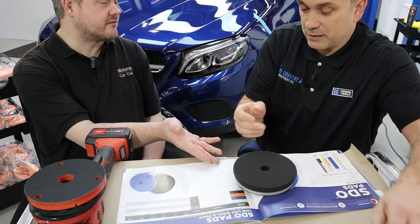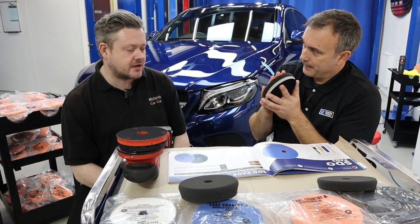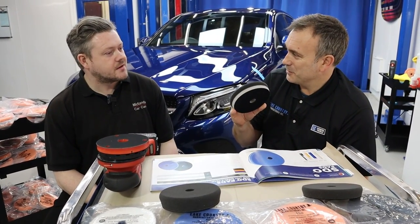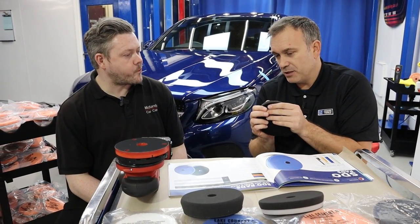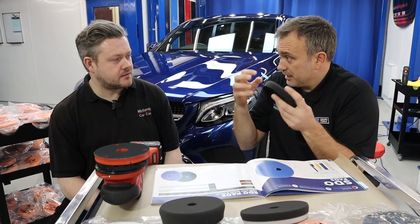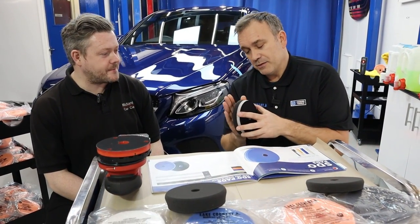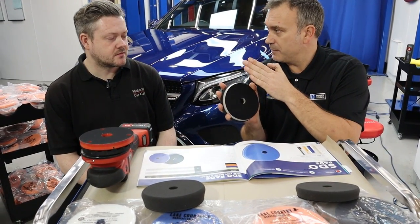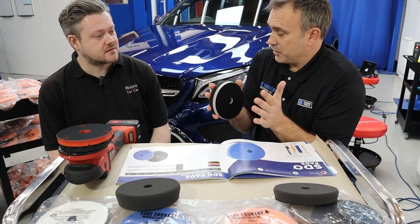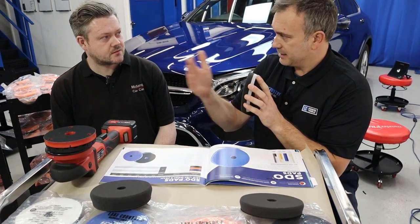So you get near to the full 15 mil cut on the face. The idea is on a 21 mil or 15 mil machine, you're going to get the full cut. Now that doesn't mean you can't use the SDO on an 8 mil, or the HDO on a 15 — but you've got to realize it's not as effective as it could be. Also, the foam's going to generate more heat, it's going to wear and could tear down and disintegrate. The interface pad also means that heat generated on the face doesn't transfer into the backing plate on the machine, and vice versa — there's a slight barrier in heat dissipation. The center hole is for alignment and cooling.